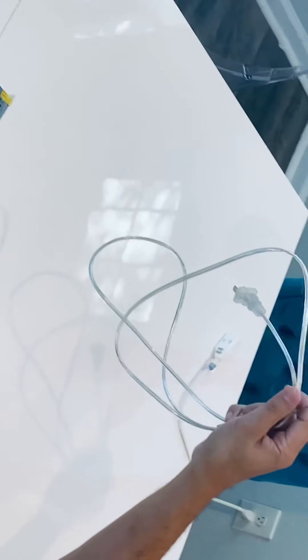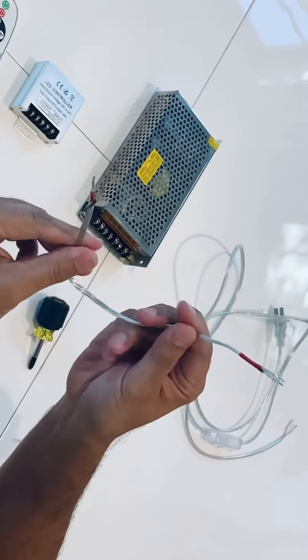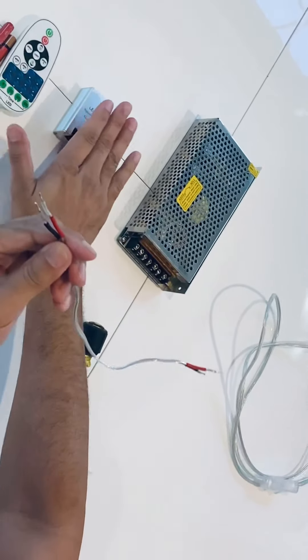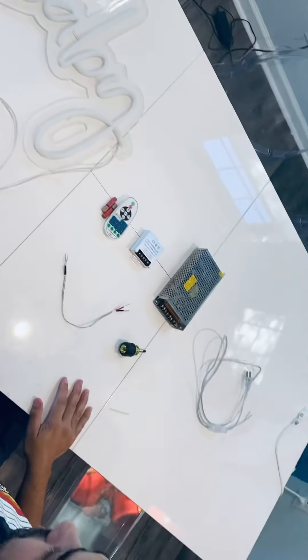You're going to have your LED controller, which is going to allow you to use the dimming functions to turn the sign on and off. You're also going to have a transformer. The transformer is 110 volts and also 220 volts, so if you have a small object like a toothpick, you'll see a little switch — just make sure it's moved over to 110 volts because that's what we use here in the U.S. You're going to have this switch, which you'll connect to the transformer, and then plug into the wall. You'll also need this wire, which connects the dimmer with your transformer, and you're simply going to need a screwdriver.